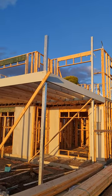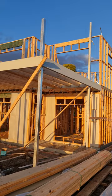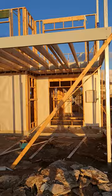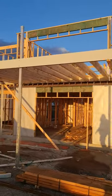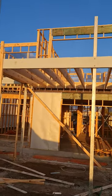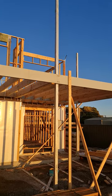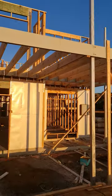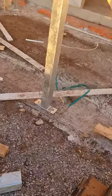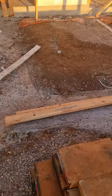Besides the can of drink up on the beam, a couple of good details to note: the beams are mitered for weathering, which is really good. You can also see the temporary timbers put in place to hold the veranda, and then we can see each of the bolts actually holding each part. We'll have a look a little bit closer at the timber work.